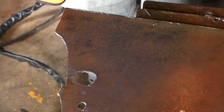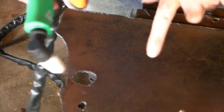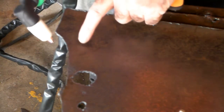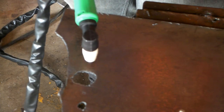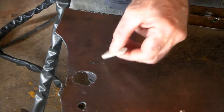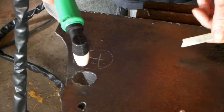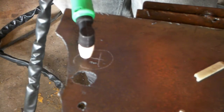So you hold your torch on an angle like that, push it through, blow it in there, and then cut your circle out. Most people go directly down and you've half-buggered your consumable. Just go like that — blow it through — and see the way that little cut has gone in that direction, into the piece you want to get rid of. The minute you go directly down it just puts too much strain on your consumable. You can angle it and then automatically come up straight — that's even better — and then you can cut straight.